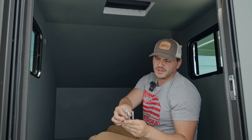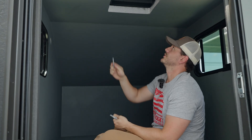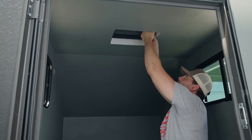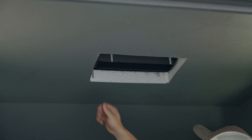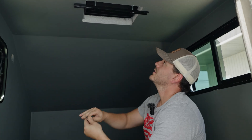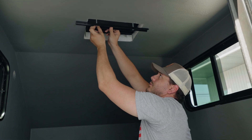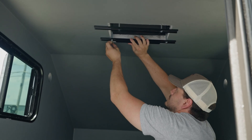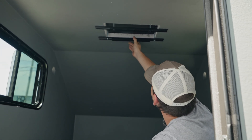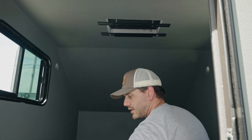For this next part, they give you these through bolts that thread up into the unit — that's going to be our anchor system. Then you take the nuts and put the channels up against the roof; this is what holds it in place. You want to make sure that your bars are evenly spaced so that when you put your cover shroud on it evenly covers. Then go ahead and tighten the bolts.